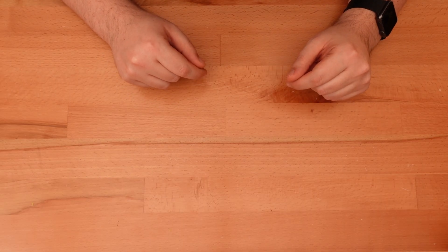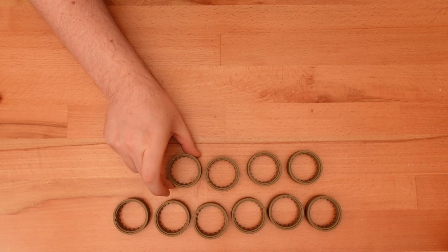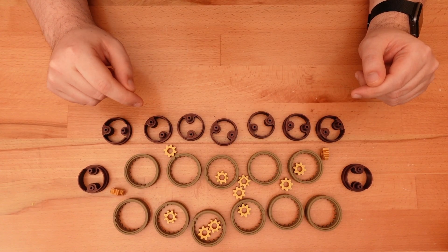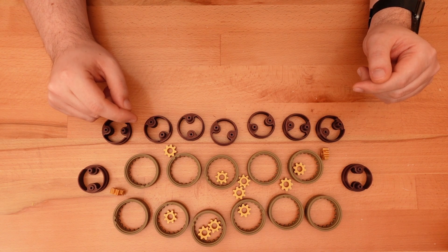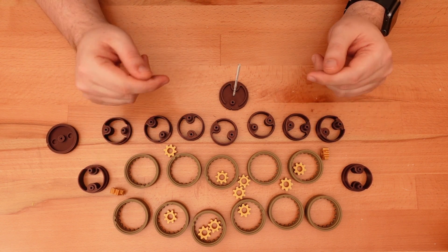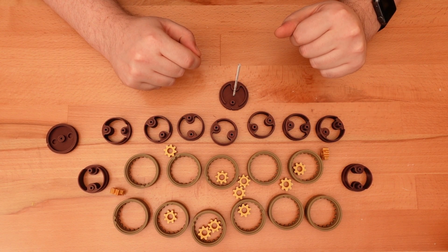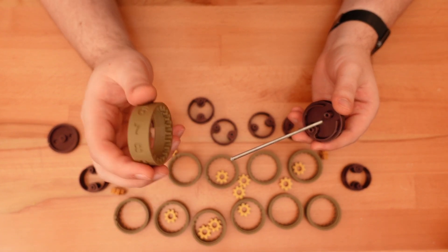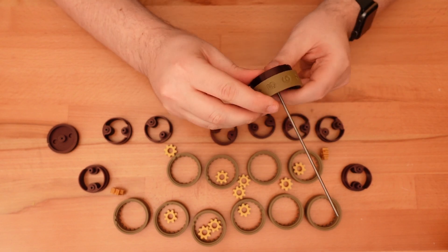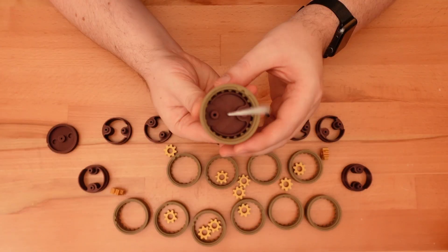Some of you are probably wondering: how long can this thing get? Well, let's find out. I've got a lot of extra parts and 150 millimeters of M3 threaded rod. For this assembly, I'm going to build this bottom-up — starting with the initial counting digit. The first thing that goes on each layer is the wheel, and it should sit on the surface of the previous layer, or in this case the starting cap, and it should rotate freely.